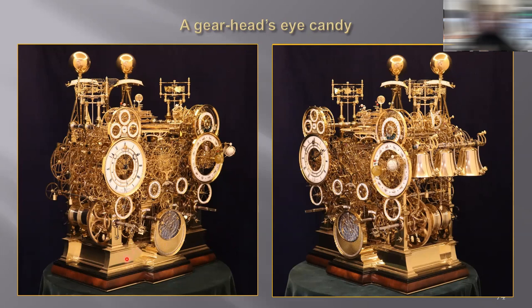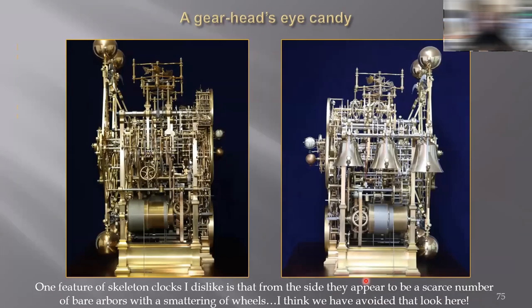Because of the weight of this machine, if the table it's on or the surface it's on is not perfectly even, you could get racking to occur if there was any deformation of this base. And of course, that racking would be magnified as you go up these pillars, and the machine would bind and you'd have a catastrophic failure. So this piece is hidden under this, and it keeps it always perfectly level at all times. And then you have a side view.